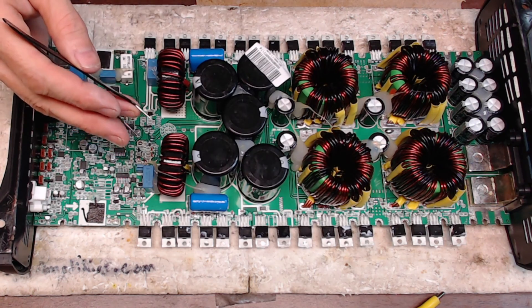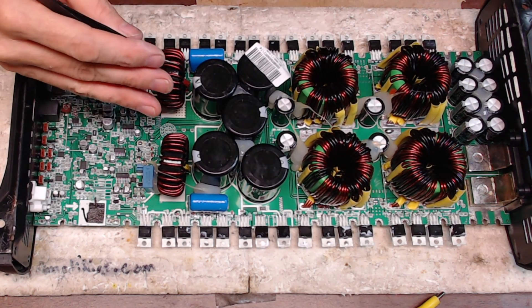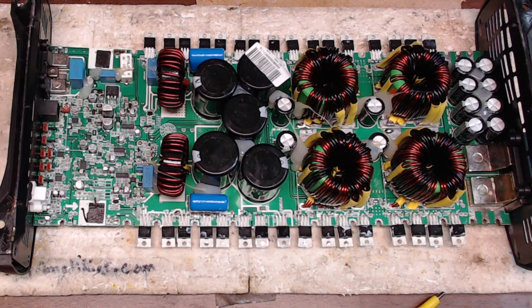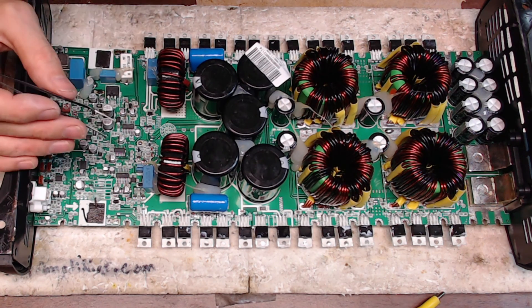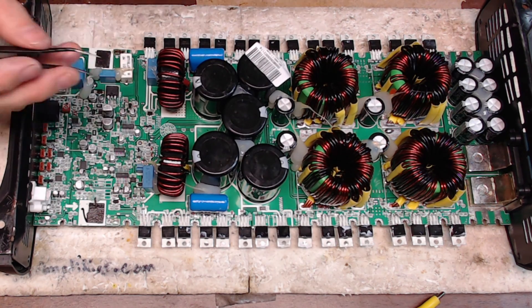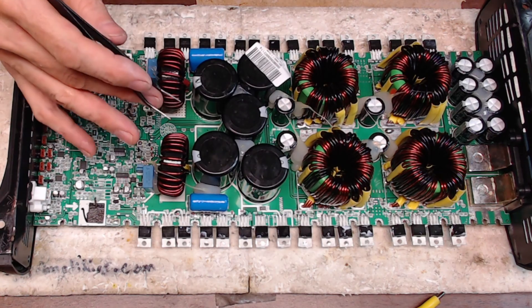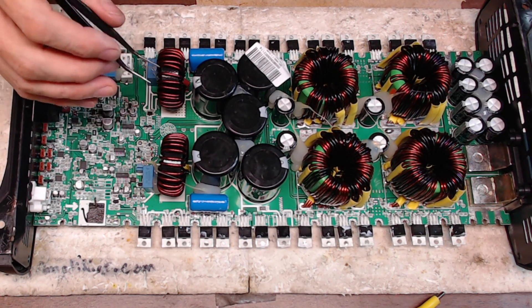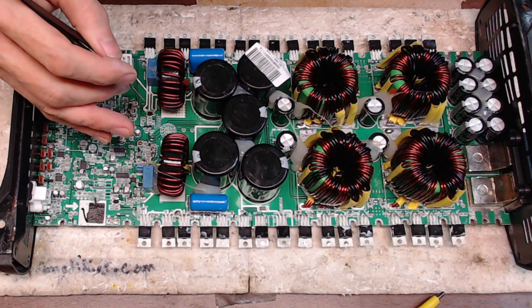It's always right at the board, so this goes back to vibration damage. Guys, please don't mount your amplifiers on your enclosure — it's just so destructive to your amplifier. If you absolutely have to do that, please feel free to contact me, send your board in, and I will go through and make sure everything is 100% secure.